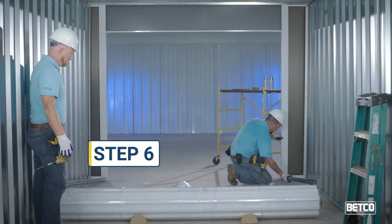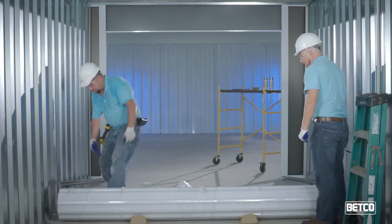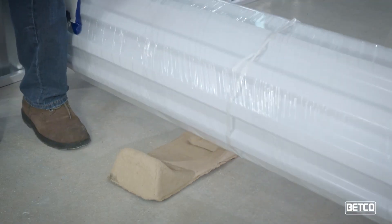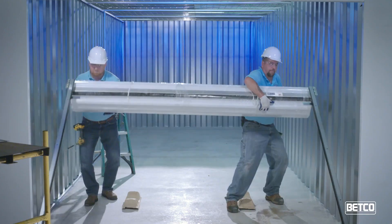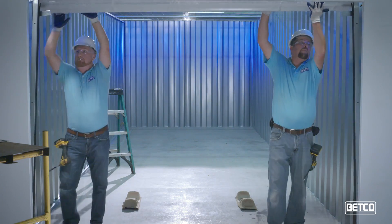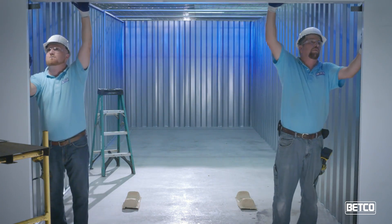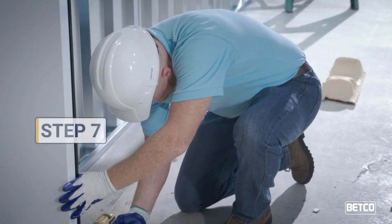Step 6. Position the bottom of the door tracks against the back of the framed opening. Lift the door axle assembly to position against the door frame. Lift the door axle assembly as opposed to lifting the door by the tracks. Door installation should be handled by two installers to lift and position the door. Lifting equipment is recommended for large doors. Do not leave the door unattended at any time during installation to the framed opening.